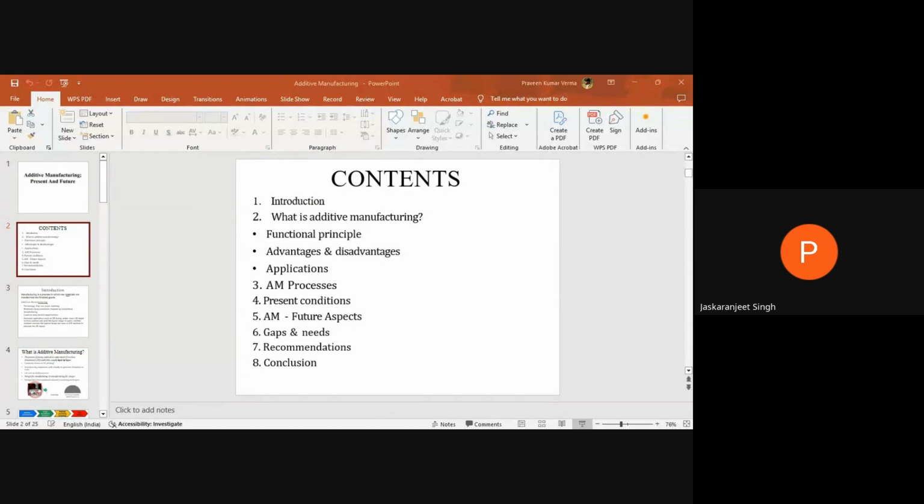So now moving on, the next one is material extrusion, FDM, fused deposition modeling. Fused deposition modeling is the most common and affordable AM process, widely used for rapid prototyping and functional part production. This process is also known for simplicity, accessibility and material efficiency. If we talk about how it works, first of all, material is drawn through a nozzle where it is heated and then deposited layer by layer.